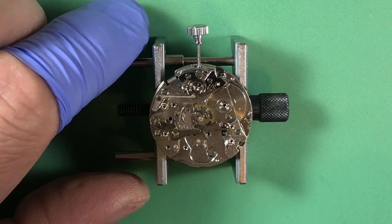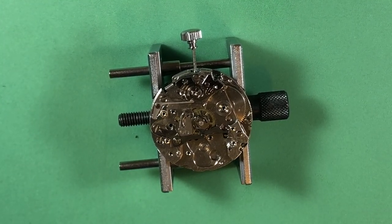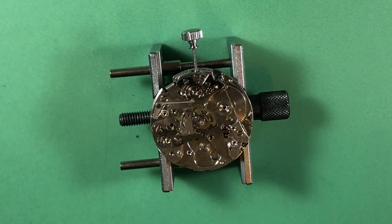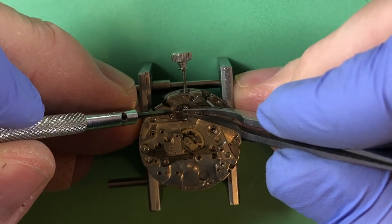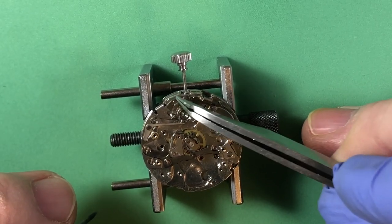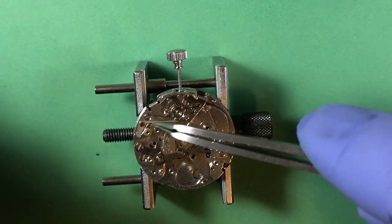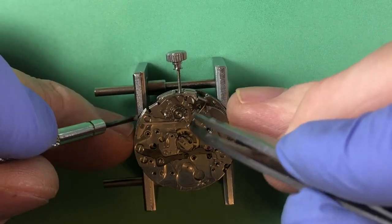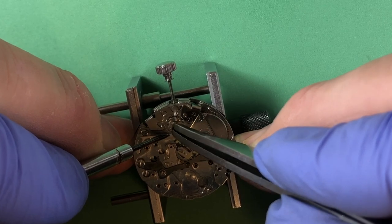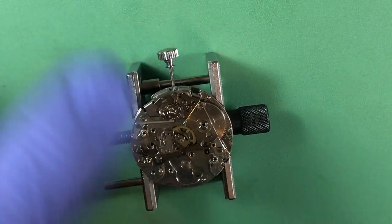Now the pillar wheel - the all-important super-duper pillar wheel. I'm doing this one off camera, I need to look at it real close, make sure I get the things I'm supposed to get. Always with this, you want to make sure that this finger is facing this way, because this will rotate 360 degrees - it's unfortunate to get this in place and then realize it's backwards.